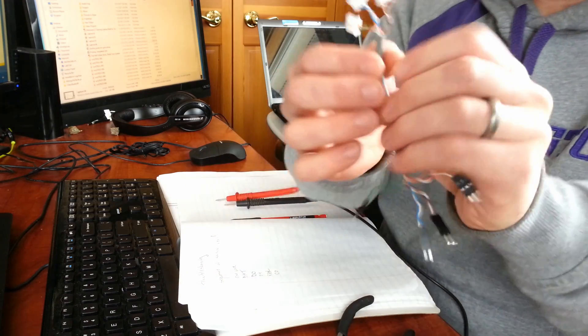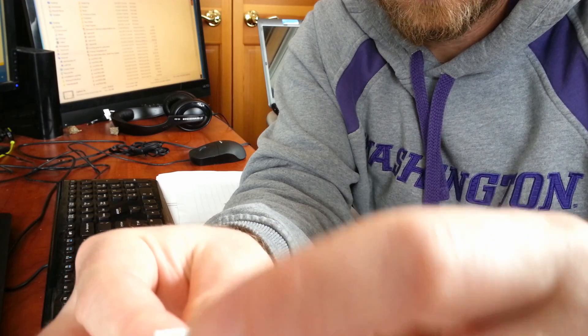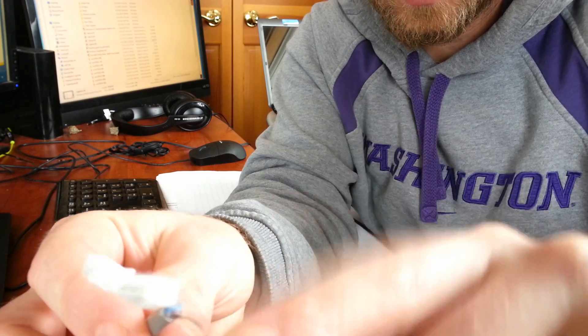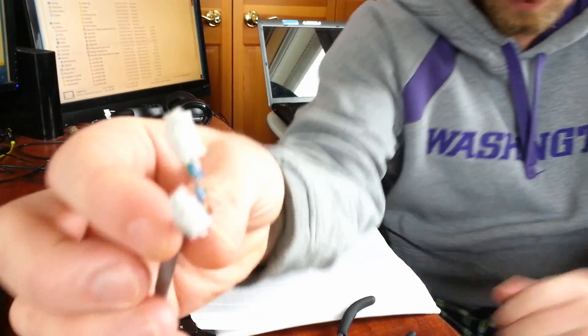I was inspecting these and they're really like a loose tooth on a few of them. So we're going to cut that one off, that one off. This one's good. We're going to cut these two off and redo the cable — hopefully that's it. I've been working on this now for the last almost four hours, and I figured out the problem isn't the circuit board, which is great. The problem is all the cables and connectors — a lot of them aren't making the proper connection.